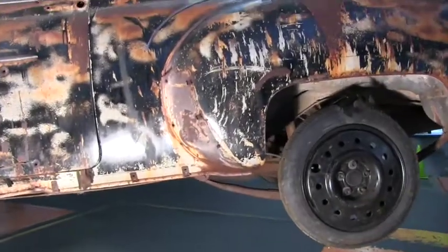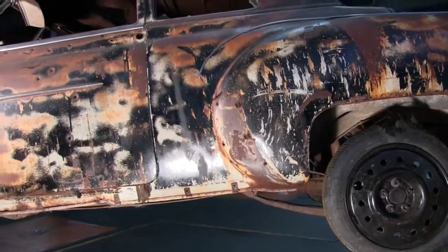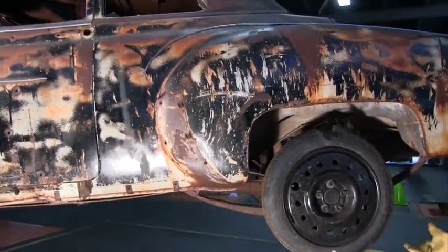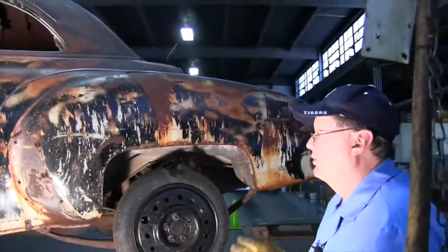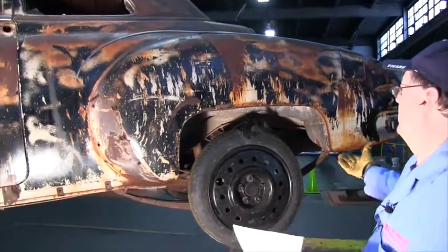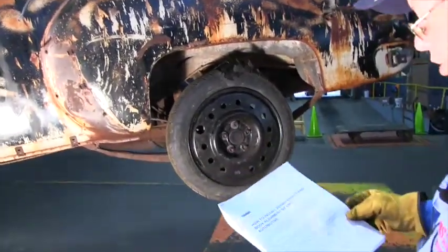Because if you got to trim something or something quite doesn't fit, just trim it, make it go in. You're going to throw the carpeting over it. You don't have to cut it out, it's just there. Our floor pans are a little extra long, so you put them in there and get your floor braces in there. And like I said, a lot of this is in our document, How to Install Repair Panels by EMS.